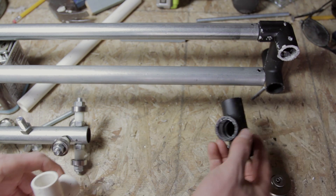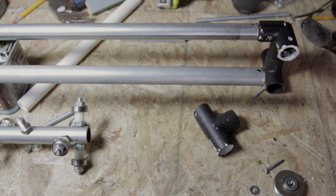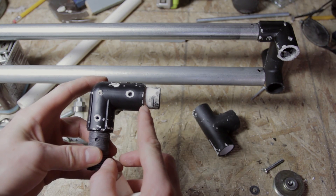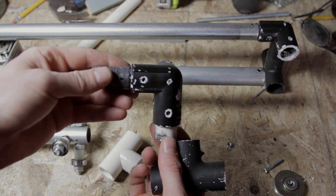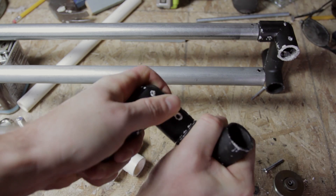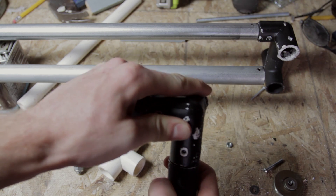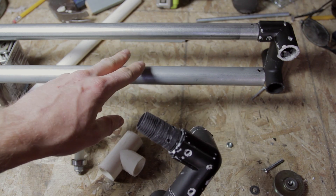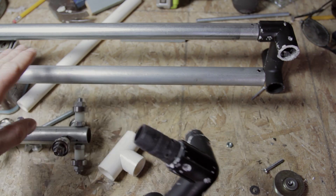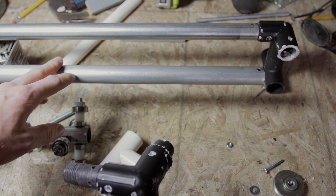Here we have our completed piece — basically just painted black. That would go onto the bottom right here like this, and then attached to that is another piece of PVC. We need spacers to go in between so that they can connect. You take your bottom foot piece and push it into this portion to form your base. For the actual joining pieces, I'm using conduit because it's metal and not PVC, so it's less likely to flex when there's weight in the middle of the track. If you use just PVC, you risk flex, and when your camera gets to the middle — especially a heavier camera — it's going to flex the track down, which you'll see in the video. The conduit will resist that because it's actual metal.